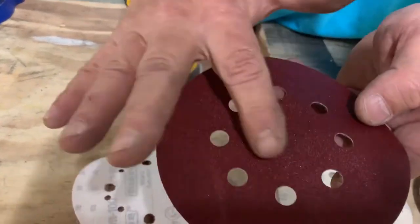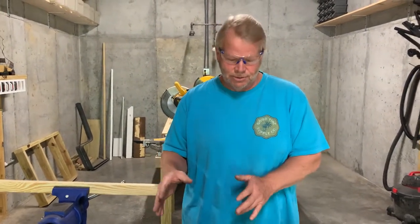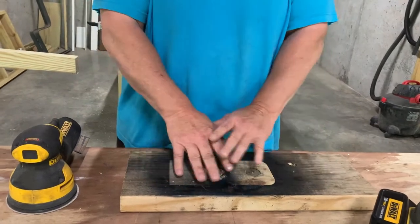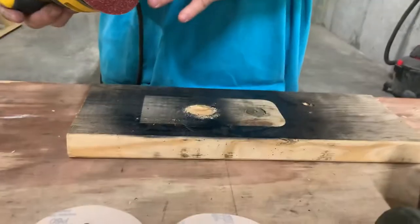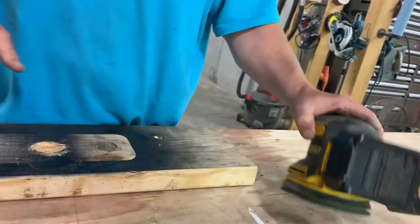You come all the way down here to a 120-grit, and you see it's very fine. So what you do when you're sanding is you work your way up. You want to start with an aggressive grit and then work your way up so that you can get it smoother and smoother. So if I wanted to sand this black off of this board, I wouldn't want to start with the 120 — it's going to gook up the sandpaper real quick. So in this instance we're going to go with the 40-grit to start, and then we'll take the battery-operated one which already has a 120-grit on it.